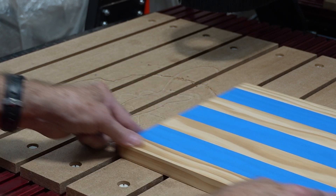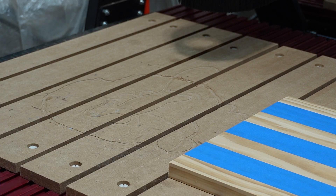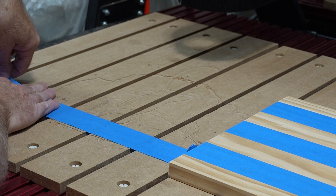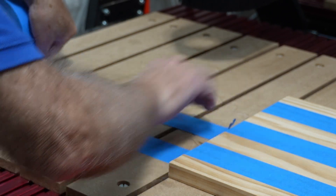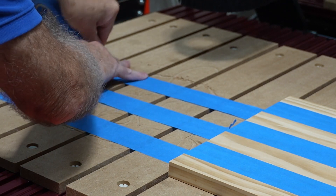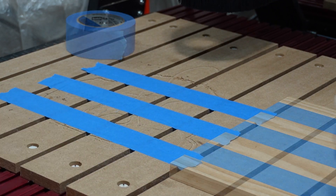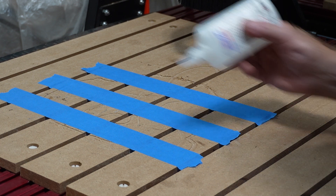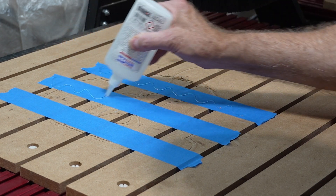Make note of that measurement and move the project off to the side as a reference so you know exactly where the tape is. Then place matching tape on the spoil board to coincide with the tape on the project. Make sure you push these down flush and flat. The next step is to apply super glue to the tape that's on the spoil board — I do it in a little squiggly pattern to get better coverage. Just a thin line will do.